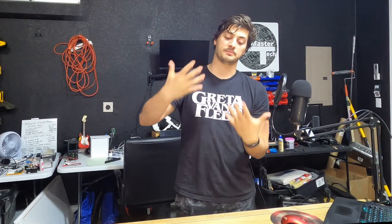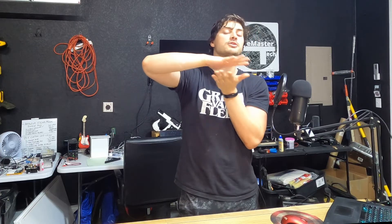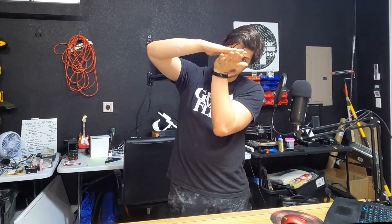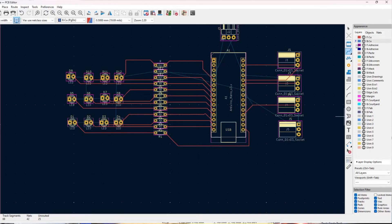On a basic two-layer PCB you can draw wiring traces on the top or the bottom layer. Theoretically you could have all of your ground traces looking from above like they're overlapping with all of your hot 5-volt traces, but you're not creating a short because they're on different physical layers of copper. This is really cool — this is the obvious advantage of PCBs, and this is how incredibly complicated circuitry gets packed down into these super simple and compact PCBs.